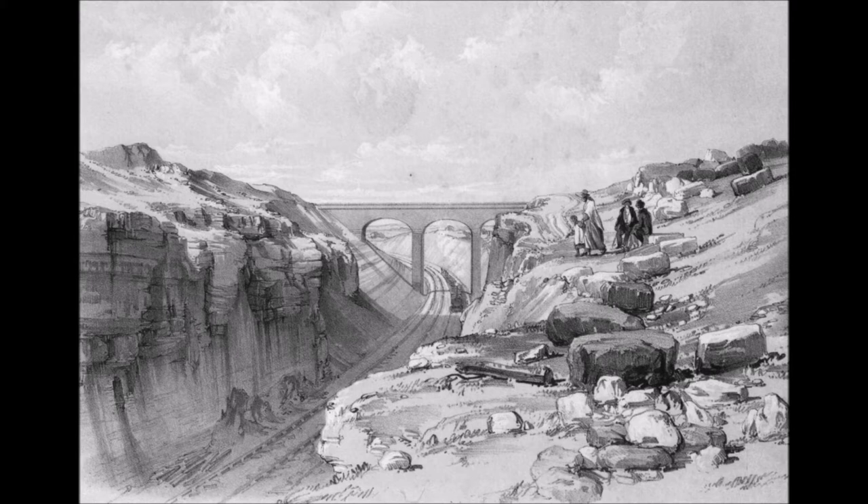You also don't want it to move up and down, and that relies on how well it's bedded into the ground. It was assumed that the track had to be anchored down and held rigid as hard as possible. And so Brunel, who accepted these assumptions of the time, devised a very rigid, very firm permanent way that would not allow the gauge to spread either side, or move up and down at all.